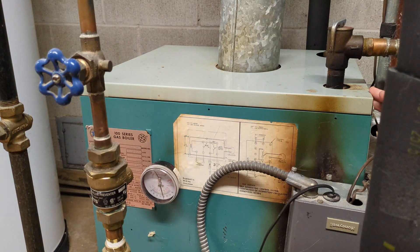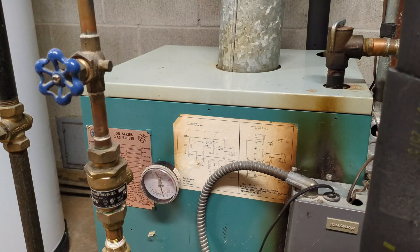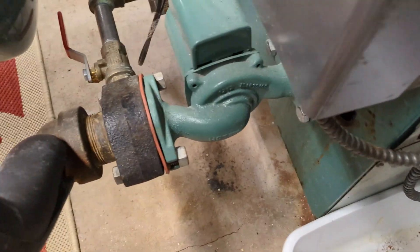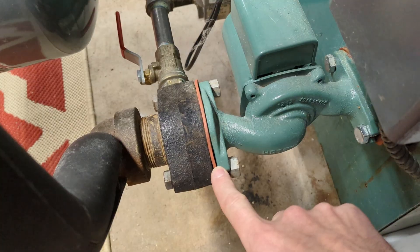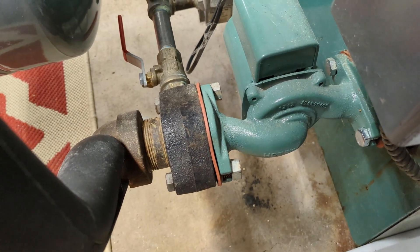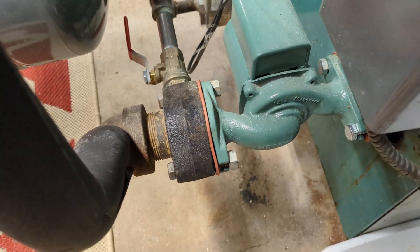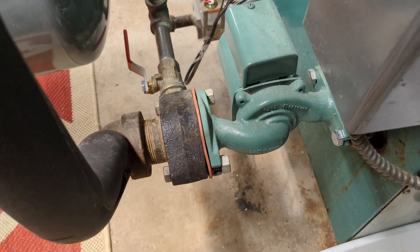Your water has been cool for a while. That seal in the pressure relief valve will get used to those warm temperatures again and start working properly. That's very similar to these other gaskets in the system — if you have cold water temperature throughout the summer because you're not using your boiler, then spots around this gasket will contract, allowing a little water to get out. That's usually why I prefer to keep the pilot running all year round.